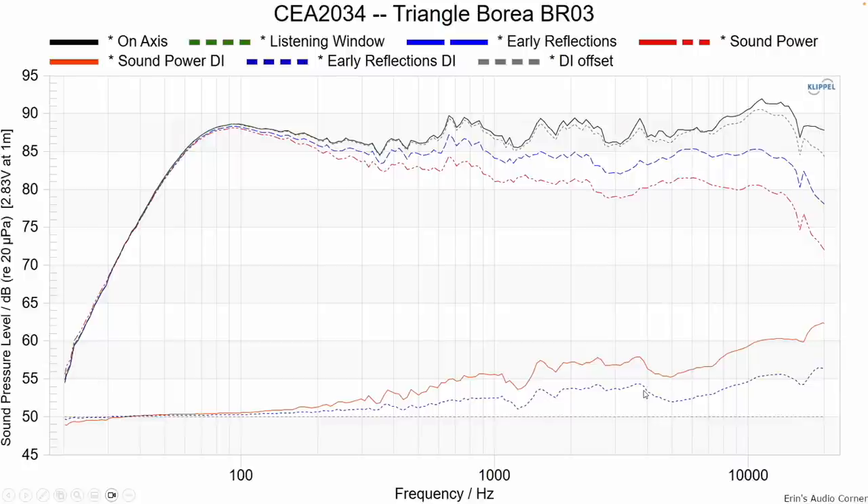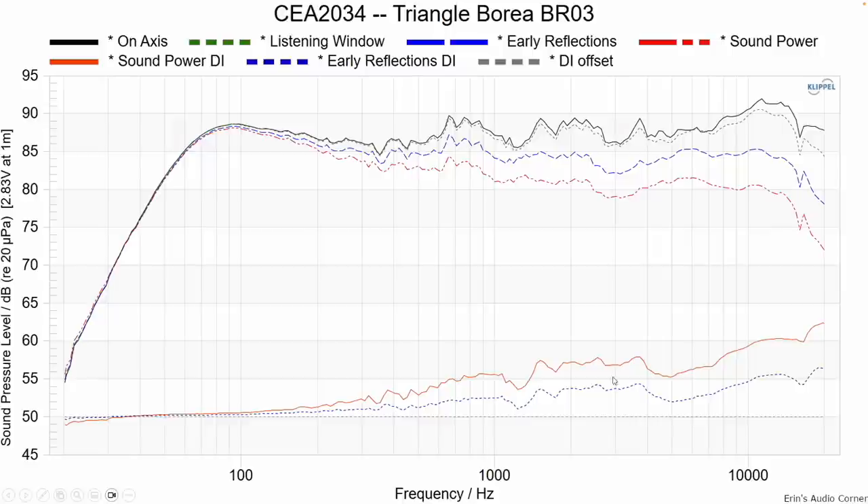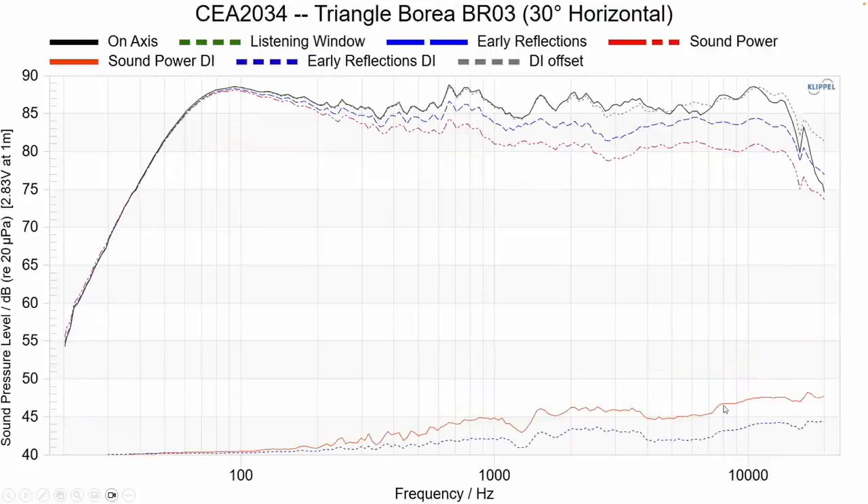Going higher, other than that directivity issue, it's okay — not too bad. But then there's a strong swing in directivity around 4 kilohertz. More than likely this is where the tweeter crosses over to the mid-range, and it's crossed over way too high. If I turn the speaker 30 degrees off-axis, the top end flattens out — we don't have the on-axis boost. But the interesting thing is there's now some mismatch in the listening window directivity. All these peaks and dips are still there; none of them are really affected. The directivity mismatch at 4 kHz is less severe at 30 degrees, but it's still there.